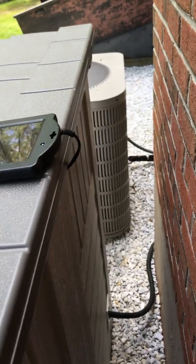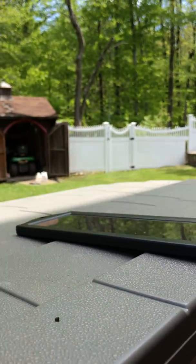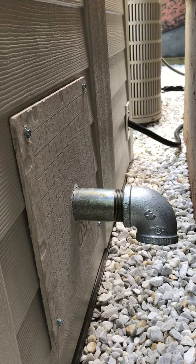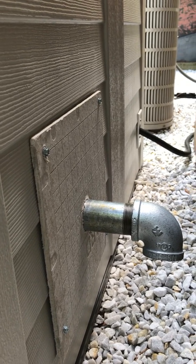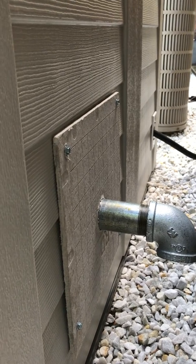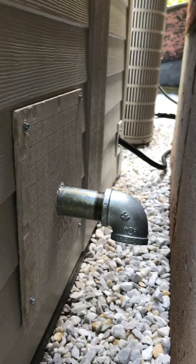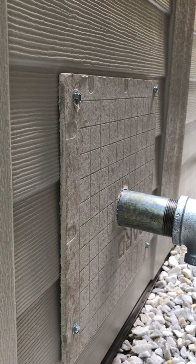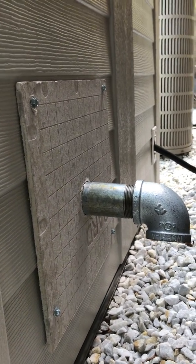I ran the cord right through the back, up and under the roof, which works out fine. For the exhaust, I piped it out — I got a screw-on flange, did inch-and-a-half galvanized pipe, and self-tapped the flange right to the heat shield of my generator. It's all pretty much hard piped in there. I also did hardy board — got a one-foot by one-foot piece on each side sandwiching the wall together. So far all the tests I ran with it work great.